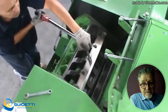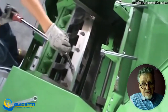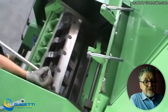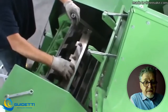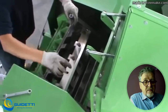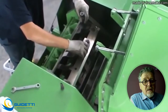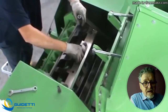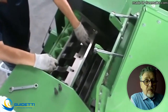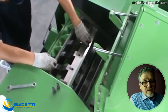Now put the knife back in the right position. Control that the cutting edge is facing down. Bring in the bolts by hand and tighten them hand-firm. Then, using the torque wrench, fix them to the indicated parameters found in the maintenance book. Do not skip proper tightening — during operation the screws can come loose and that will damage your machine. To tighten them safely, place a hammer or a wooden piece to block the knives, and then apply the torque wrench with the correct strength. It is dangerous if the knives start to rotate during that operation.